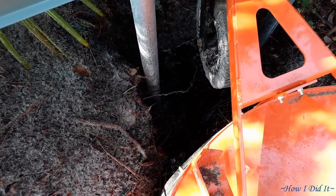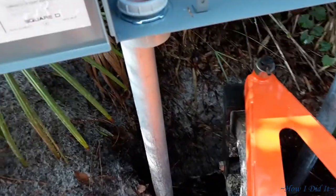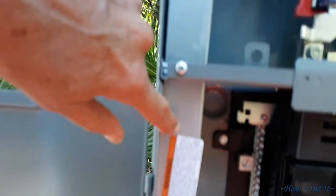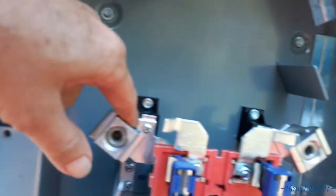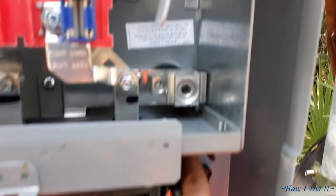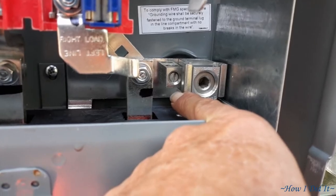Here it's rounded over - it keeps the wire from possibly getting chafed by the rough edges, and that goes on top. The power is going to come in down there through two-inch PVC, run up, and I'll glue it into the bottom. It's going to come in right here and go up through this channel chase. 120 and 120 will give you your 240 service. The neutral will come down over here and tie in, and then the ground will go there.